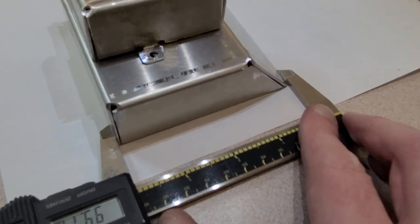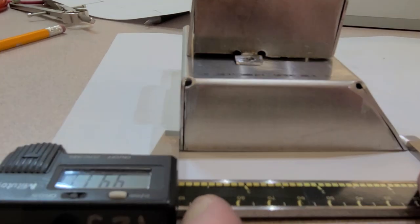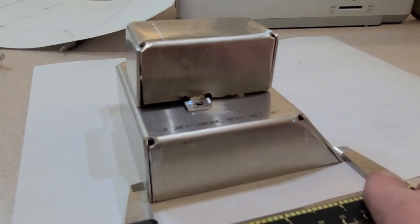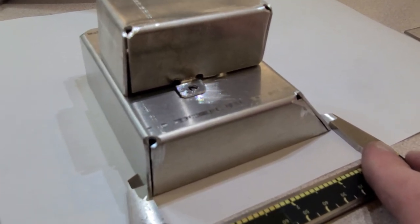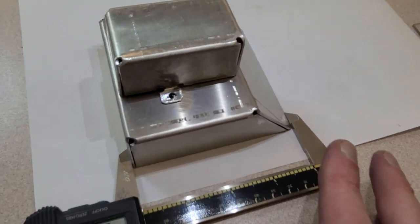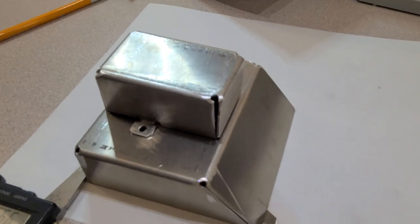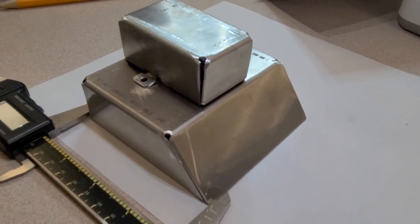We're at 99. It looks like maybe one or two of those bends could be just a little bit tighter. But that's why we designed it to be 97. We're off by 2 millimeters, and we're still under the 100 millimeter by 100 millimeter limit. So this is a competitive robot that won't run into any problems with the sizing box.